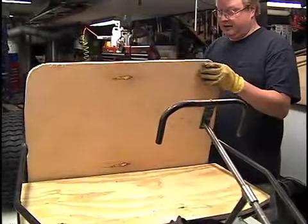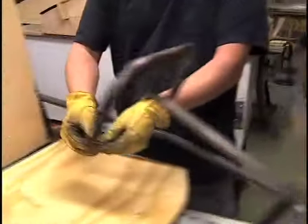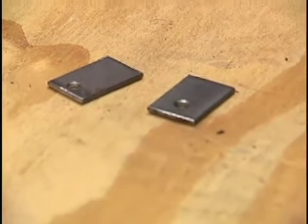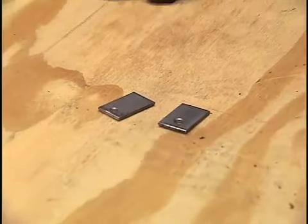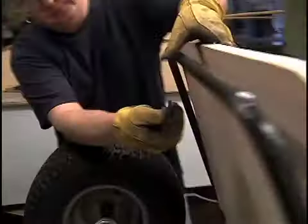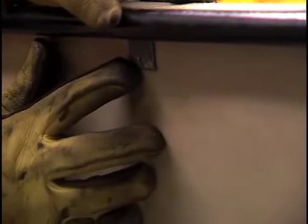What I did was cut it to shape, and now what we have to do is weld on these little tabs here — I made ten of them. They're basically one-inch wide strapping, about an eighth of an inch thick, and I drilled quarter-inch holes in them, then cut them up into pieces. I cut them up after I drilled all the holes, which made it a lot easier to hold the work in the drill press. So we're going to weld these underneath here, and they'll go in like this — that'll allow us to put a wood screw into the wooden pieces.